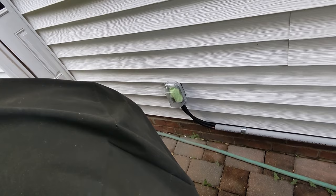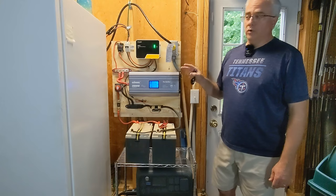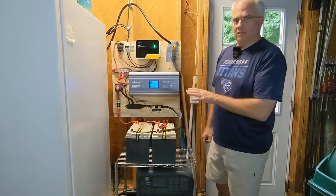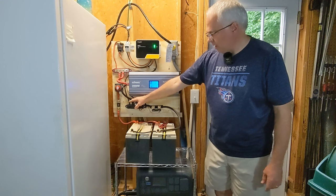That'll do it for this video. Hope you enjoyed me covering the 12 volt system I've been using for a couple of months. I will be moving to a 24 volt system coming up soon and I'll make a video on that. I believe everything I've done here is safe. If you see anything that is unsafe, please let me know. Someone told me I needed to have the fuse block before the switch — closest to the battery — so I did make that change to make this safer. If I've done anything wrong, let me know — I'll fix it and might make a follow-up video if it's important enough. Thanks for watching.